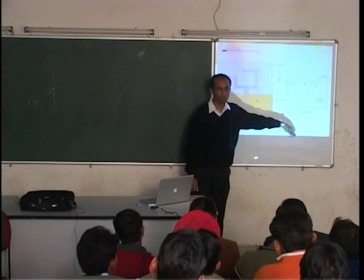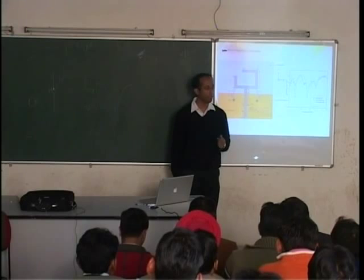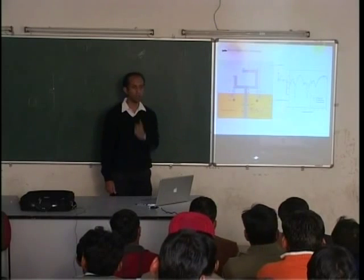S11 very low means the antenna is working. S11 low means no reflection, power is going out, being radiated. S11 very high, close to 1 or 0 dB, means the antenna is not working. Whatever power comes in goes right back.